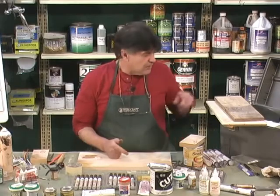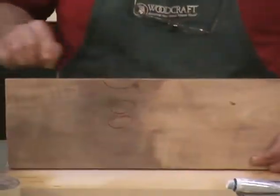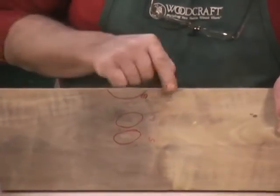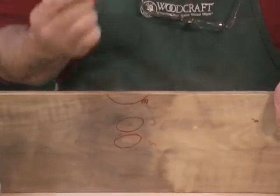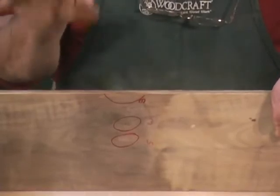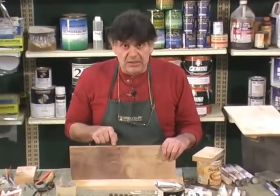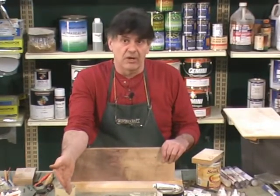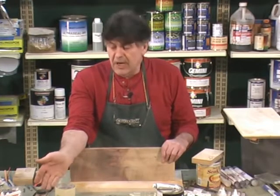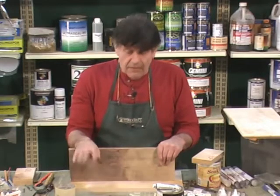An example of that would be something like this piece of walnut right here. And this is where I've got, if I had a corner, or in this case an edge chipped out. Now in the case of a corner or an edge, I would try to maybe hand plane it flat a little bit and glue a piece of wood on it if I could. But in areas that you've got to have a lot of strength, or that are going to be subject to any kind of abuse, as in the corner of a drawer, a really super sharp little fine edge, or like this on an edge, your standard putties, whether it be solvent or water, just are not going to be strong enough. They're not going to do it. Everybody out here has put a little bit on a corner or something, and you close the drawer and it just pops off. They just aren't that strong. They'll tell you they are, but they're not.